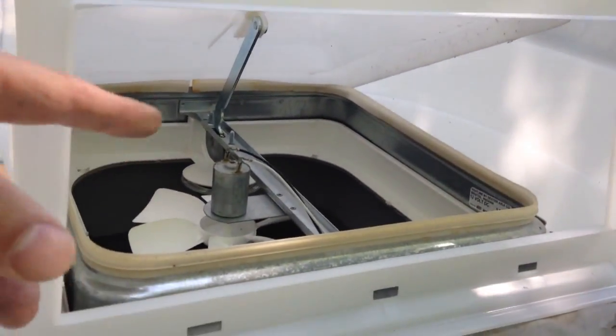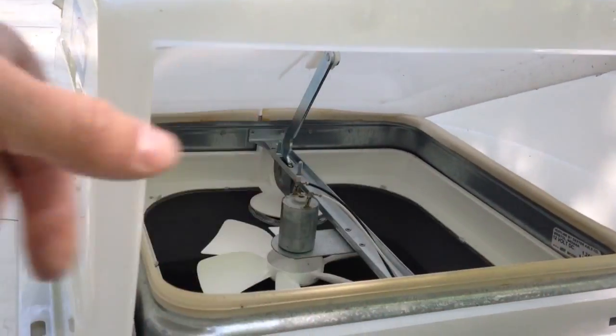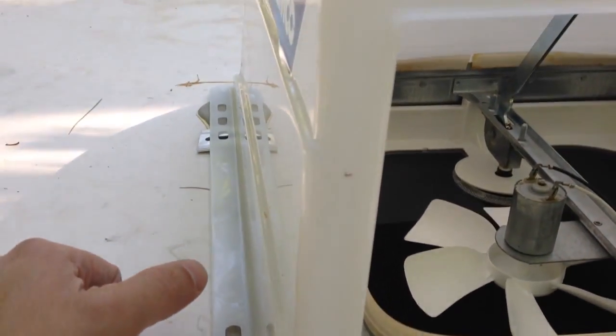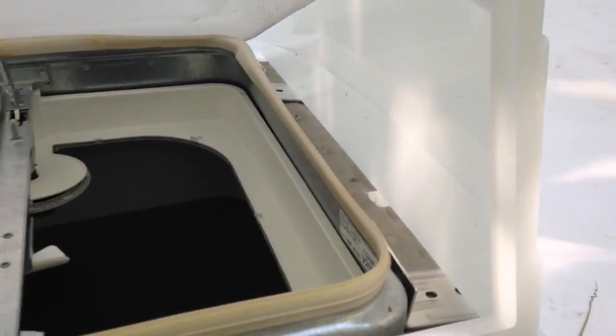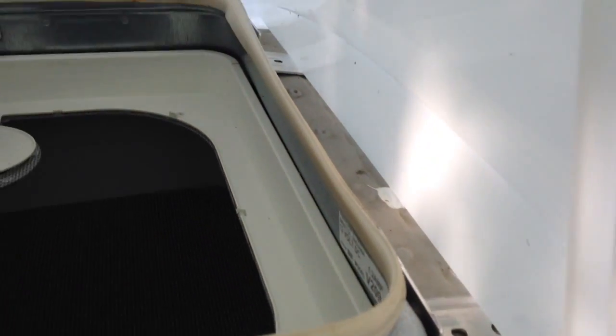What I'm doing is I took the front screen out — there are two Phillips screws that come right out. The vent comes down and now you want to line up all your metal brackets. With the screen out you can see the cover is positioned nice and evenly over the vent cover, and you want to get the brackets as close to the edges as possible.